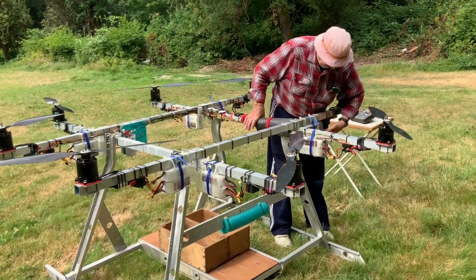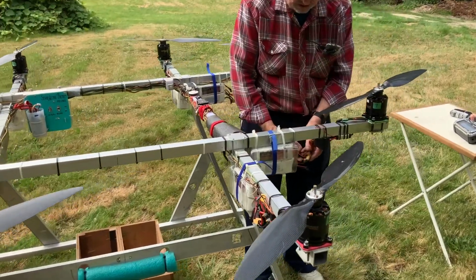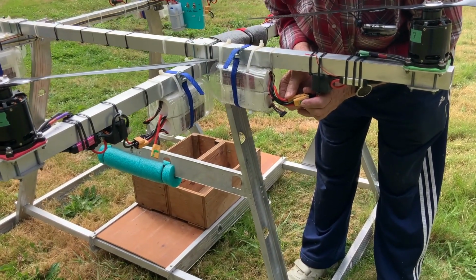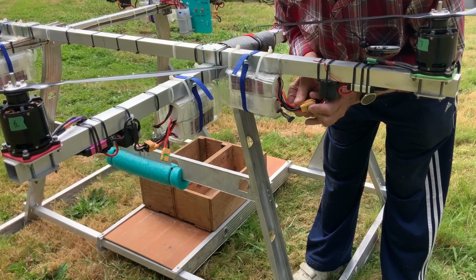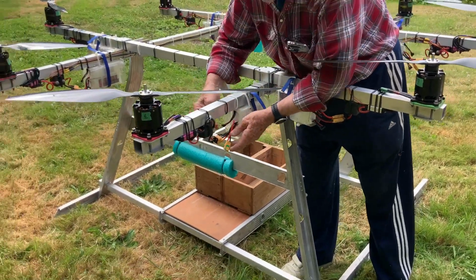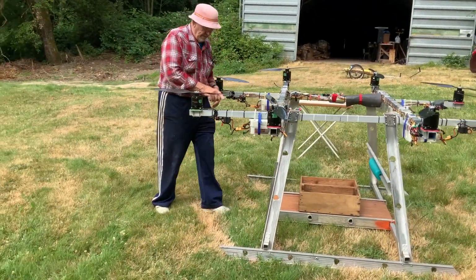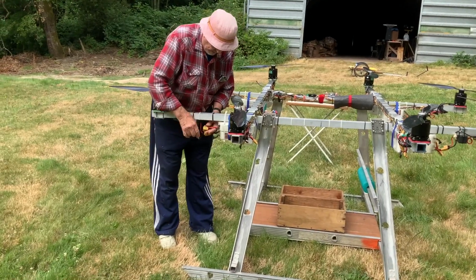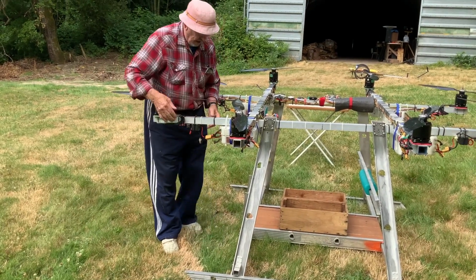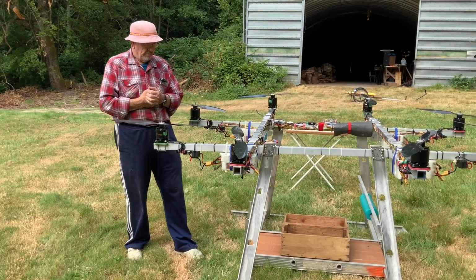The batteries are 2 6-packs, which I have serialized on plugs here so that I can plug in half of the battery pack without affecting the other half. And then when I plug in the second half, now we have 12 volts available to this relay, actually, or these relays. These plugs have resistors in them, right in here. They're indicated by this green marking on the plug. And what the resistor does is ground the enormous spark that happens when those batteries are plugged in.